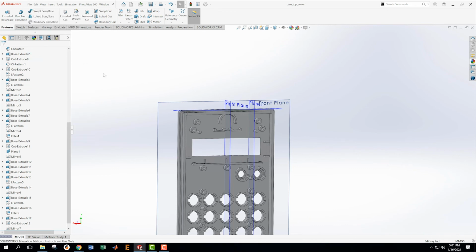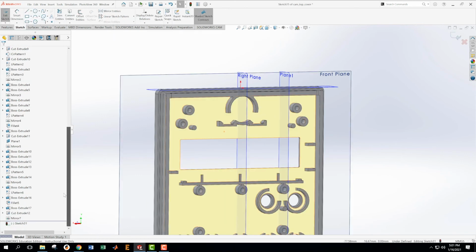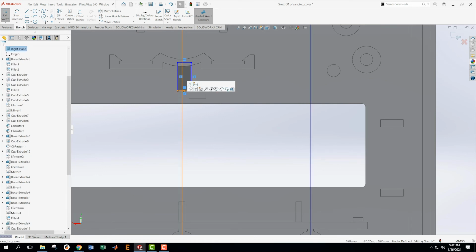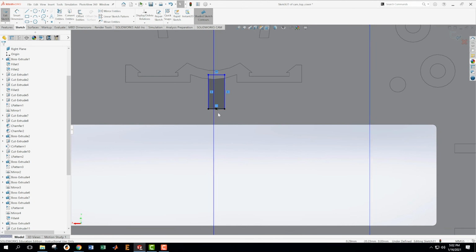Save. And I have one more little thing to do. There's like another little thing right here, another little rib. Okay, I'm now in sketch 31. I'm becoming an expert at sketching. Okay, so we're going to have this go right up in here, like this. I've done this offset so that I can get the center point without it sitting on top of the plane. Okay, so make intersection. We could actually do that, but I want it to give me the coincidence. Why it will not give me the coincident, I don't know, but the make intersection will also work.